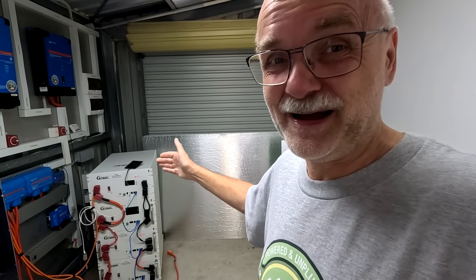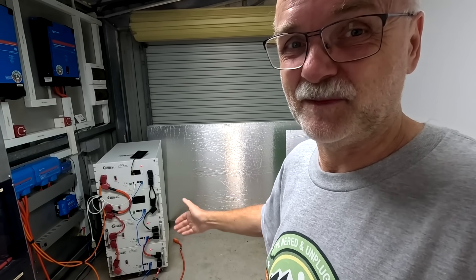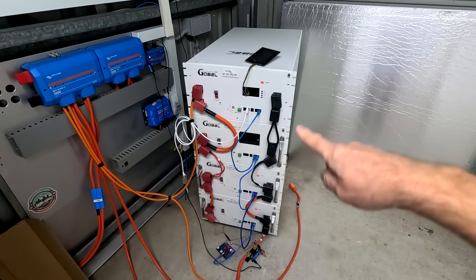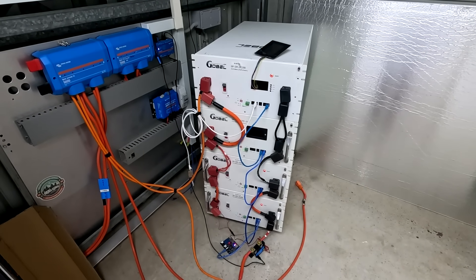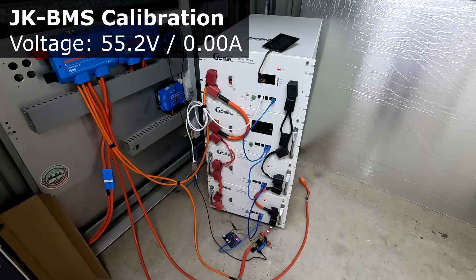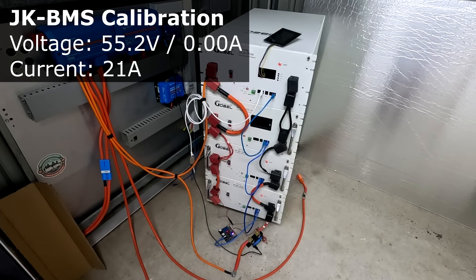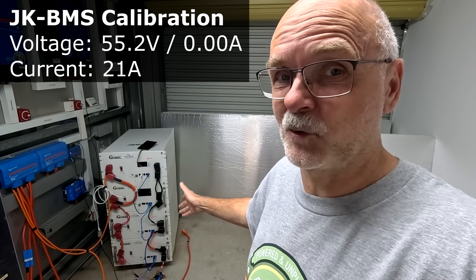Is there a difference between version 14, version 15, and version 19? Have they maybe improved anything in version 19? Let's find out. The total capacity of this battery: 280 + 314 + 280 + 304 ampere hours makes 1178 ampere hours total. Times 3.2 volts times 16 per battery gives a bit over 60 kilowatt hours of energy storage — slightly larger than the battery in her vehicle. She's not using the car every day, so the solar has time to trickle charge and replenish the energy used. This will be a bit of a long-term experiment. We've calibrated all the BMSs at exactly 55.2 volts, and also isolated each BMS and calibrated it with a 21 amp current, so all four BMS models experienced the exact same calibration method.